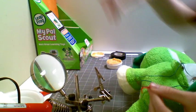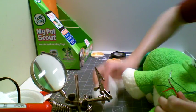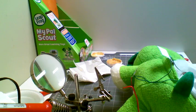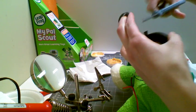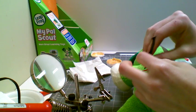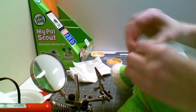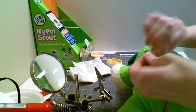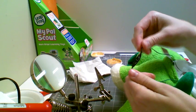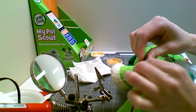Cover the wires together with the solder. I have the wires soldered together and I'm just going to dab off any excess flux, making sure not to drip on the toy. Now I'm going to take my electrical tape and just wrap it completely over the metal — there should be no metal showing. This doesn't have to be very pretty since it's going to be on the inside of the toy. Now I have the two wires connected together; when I pull they're not going to separate and they are protected by the electrical tape.